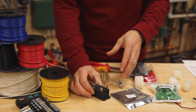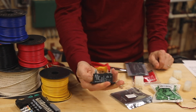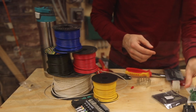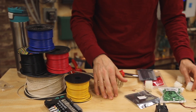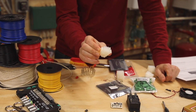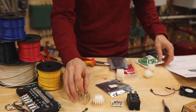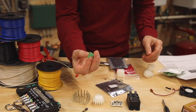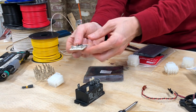In order to create the hydronic relay kit, we're going to need several items. First, we need the relay itself. Next, we're going to need the control board, which hooks straight up to the relay. After that, we're going to need several spools of wires to create the overall harness. Next, we're going to need a 12-pin connector that will connect up to the wiring harness in the air handler, and we're going to need the connectors for inside of that wiring harness. The final item is a two-pin connector with two pins that connect to the air handler.